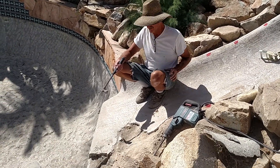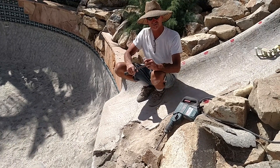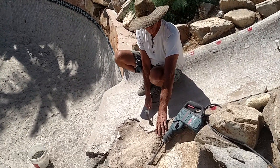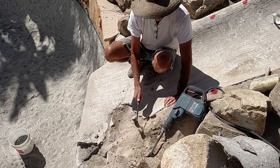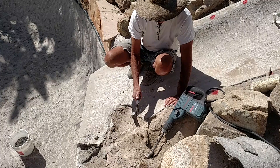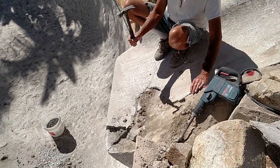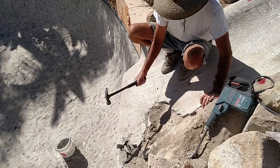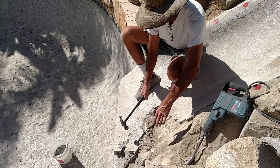Dave at your house over here in Alpine and the slide. I start tapping with the hammer and there's some failing structural gunite underneath there. It's just very soft. All this has been done with just my hammer and it's dangerously so. There's a crack running through here and I'm concerned that this whole thing would just collapse. We're losing some of this structure over here.